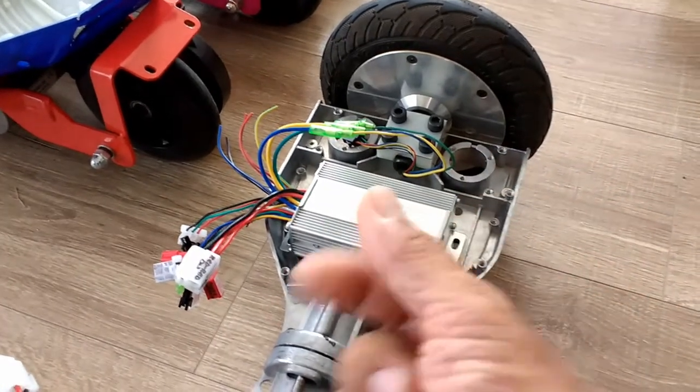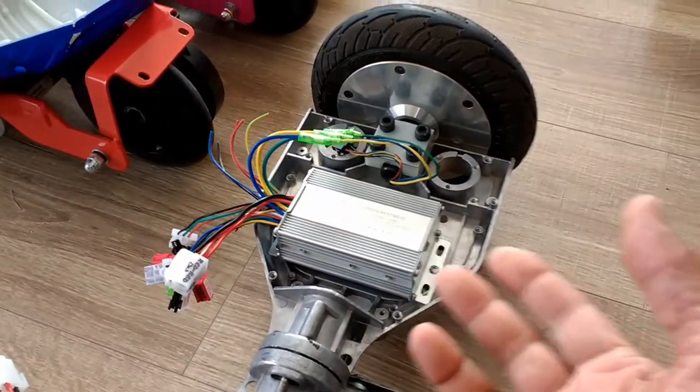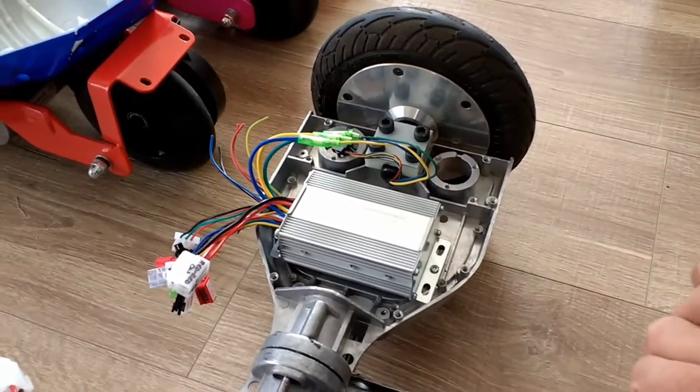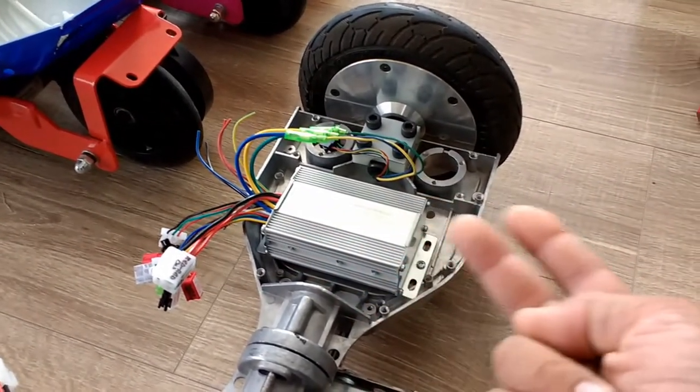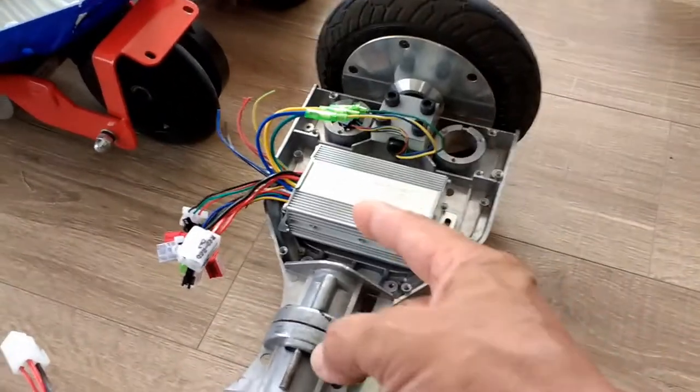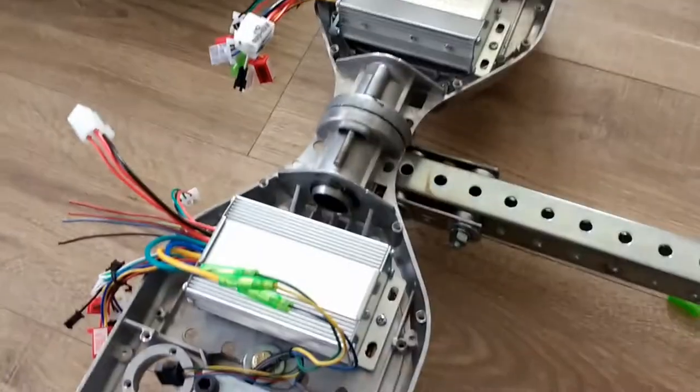I'm more used to the controllers that I use for charging individual cells. I like having them separate. If you have a 4-cell, you have 4 wires attached to each cell, and one for the ground, and that's how you charge each cell individually. You balance charge those. So I'm more used to those types of batteries, and so that's how I'm redoing that battery that sat on this one here.